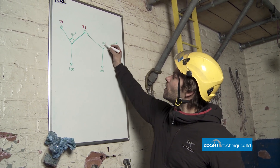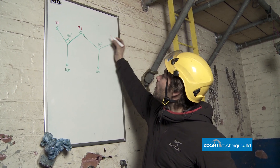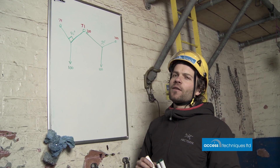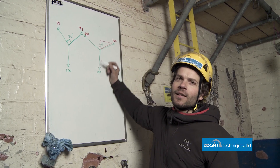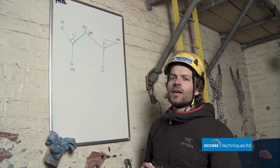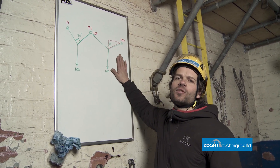If we get up to 120 degrees with 100 kilos, we're looking at 100 kilos on each side. The formula to work this out is fairly simple — it works on trigonometry, we create a triangle, work out the lengths of the sides with cosine, and it gives us an answer like that — but that's not much use out in reality.